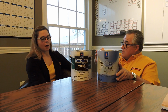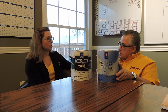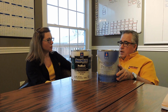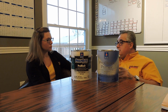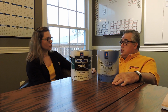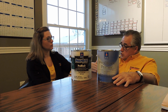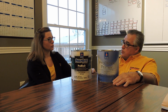Okay. Well, what about if you're changing drastic colors? Like there's no stain, but you need something to dull the color before you want to change up the colors. Can this one work for that instead of going to the heavier? You can. You could use Prep-Right. That would work very well. And depending on what type of color we're covering and what color it's going to become, you may want to either tint the primer or use a gray primer to give you a clean slate, so that the first coat of finish will stand, and you'll have less probability of bleed through, and the second coat should do it just right. Oh, that'd be great.